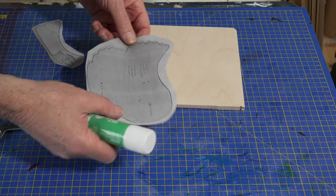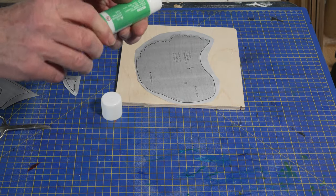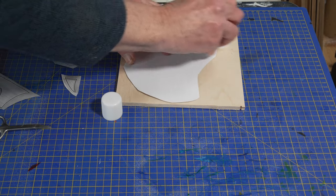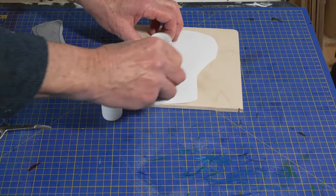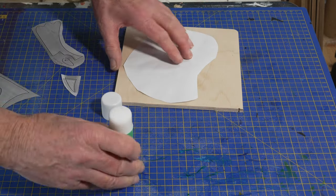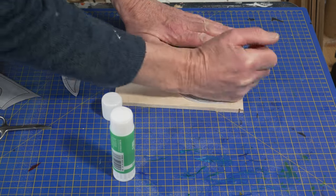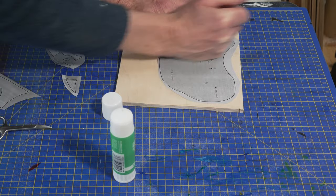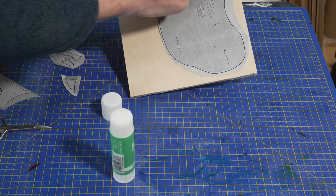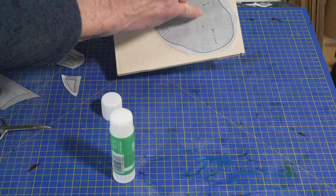Cut the paper templates out and then stick them with Pritt glue — this is some sort of knock-off, but it seems to work. No need to stick it on too tight, but you need to hold it in position and keep it flat for when you saw it and drill the holes. This is on 6mm or quarter-inch plywood. What we've got to do here is cut around the profile — we need two of these, and I usually clamp them together for drilling the holes.